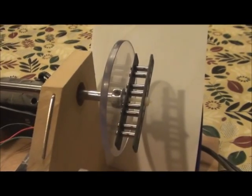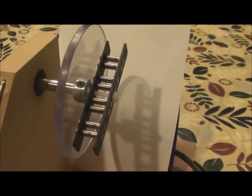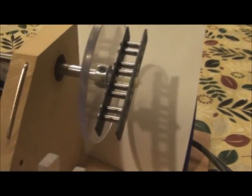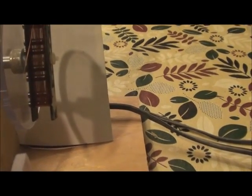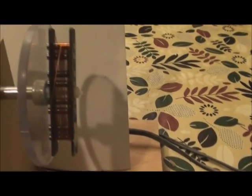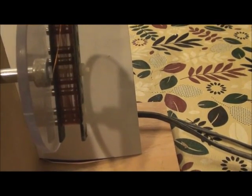Here's a shot of the bridge pickup, bolted in, mounted onto the spindle. It's going to be clockwise, south up. The neck will be counterclockwise, south down or north up. And I will get it prepared with some wire, and then we'll do some winding. Okay, I'm going to attempt to do this while holding the camera, but as you can see I've begun the winding here. We're just over 100 winds, and I'm going to begin the rotation here. Right now it's not going very fast.